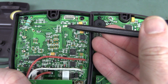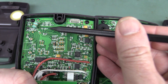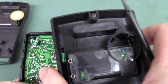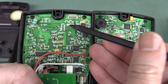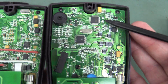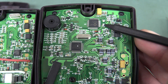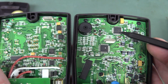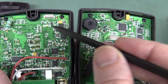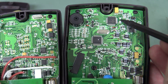There's our little infrared lead there. Notice that it only transmits - it does not have a receive, even though there's two holes in the case: one for transmit, one for receive - it only transmits the data. And interestingly, the EEVblog BM235 has a pad here for a diode - look at that! And it looks to be in almost identical location to line up with that hole, pretty darn close. So I thought aha!